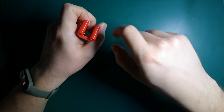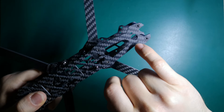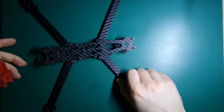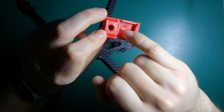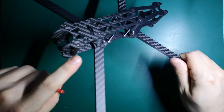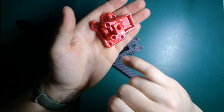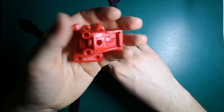For the frame, if you want to mount the SMA pigtail you have a hole for the SMA right there. But if you want it nicely soft-mounted, I used 3D prints — one for the SMA, and I may install GPS later. I also used a GoPro mount and an ELRS antenna mount. If you don't have these mounts, you can mount the ELRS antenna on the arm, but I have a 3D printer so I just printed them. You can also buy them from AliExpress if you don't have a 3D printer.